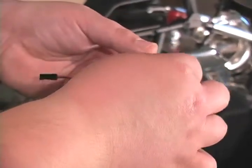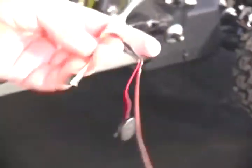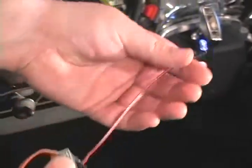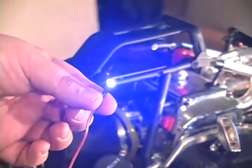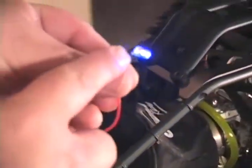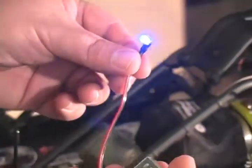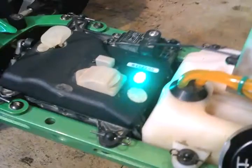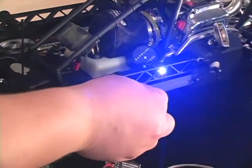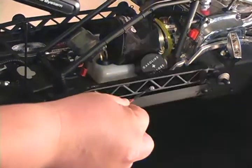The red Dean's plug here is for an optional LED, which, when connected up, shows you the status. This LED does the same thing as the onboard one, but it can be mounted where it's easy to see. You can drill a little quarter inch hole in the lid of your battery box, stick the LED through, and a little lens is included that fits over top to keep it protected. You can then visually see the status of your kill switch — it will turn off when I flip the trim and the buzzer sounds, and when I turn off the transmitter, it will flash.